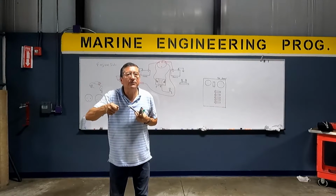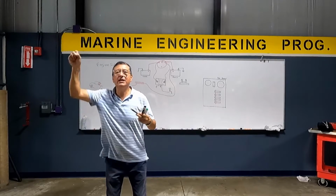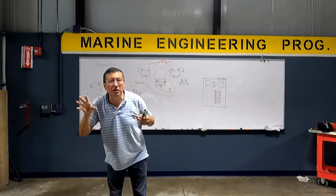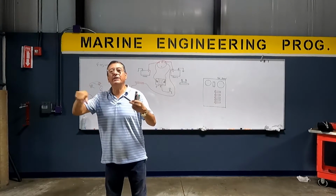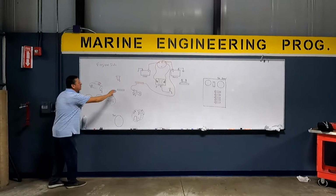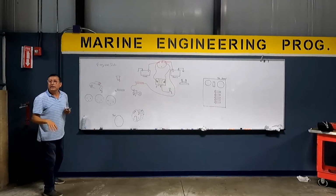In your car, the first thing you hear is a lot of beep, beep, beep. The lights, the antenna, the radio turn on, yeah? A lot of elements, and you hear the fuel pump, no? Beep. You activate a lot of elements. For that reason, we are going to create an ignition bus bar. And with that ignition bus bar, we are going to feed all the instruments, tachometers, everything.